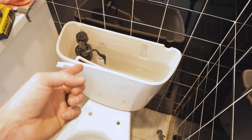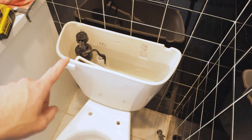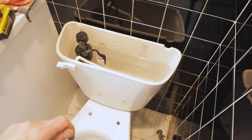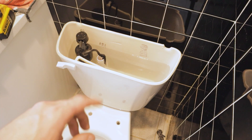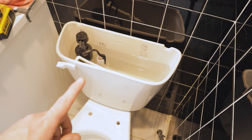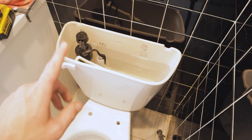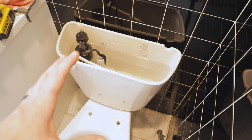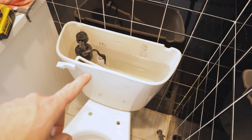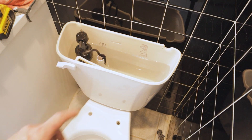The reviews did say this toilet can have a weak flush and fills relatively slowly. Standing here I can confirm the tank does fill slowly. There's apparently a little restrictor in the water line that you can remove and the bowl will fill faster. It feels about the same as the older toilet downstairs, not as quick as the other upstairs toilet. That said, this bathroom is not slated for remodel soon - this toilet was only about a hundred bucks, so for now it'll do just fine.